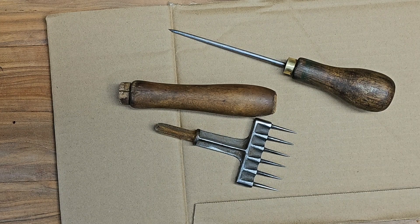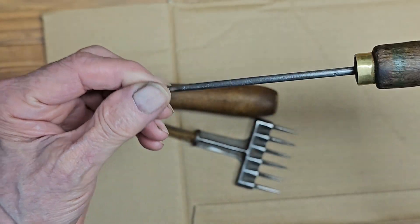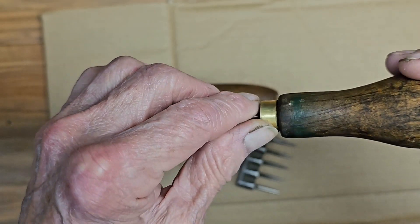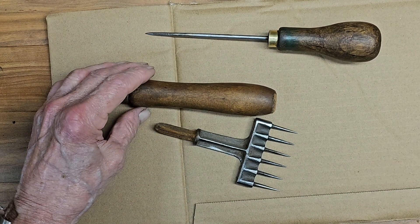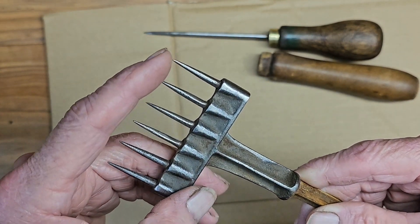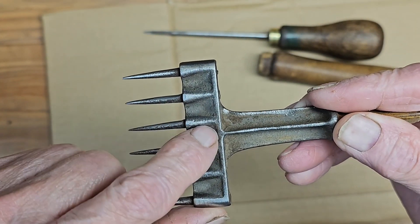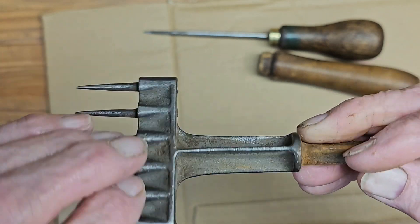Let's take a look at where we are on restoring these two tools and where we're headed. Did some preliminary work on the ice pick and got most of it done — still got a few little flaws in the shaft. There was a little brass ferrule on here and the wood has to be scraped and redone, but it's coming along nicely. A little different story on this chisel — it's got nice five or six sharp prongs on it and they are good and sharp. To get down in here I'm going to have to use a fine little wire brush and the Dremel, because you can't get into these areas with a standard wire brush.